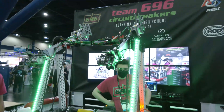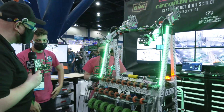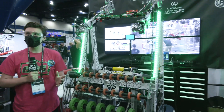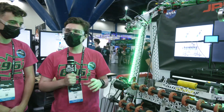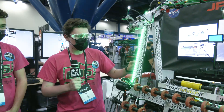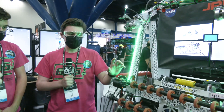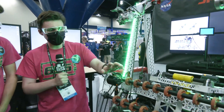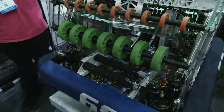That's the whole climbing sequence — it looks fantastic and has been working great. Dino, talk about sensors and programming. The first major thing is the code for the shooter. We spent two days building a lookup table instead of using an equation. We placed the robot one foot away from the hub and incremented outward, trying shots over and over until it landed every time, until we had a full table of every shooter hood angle and flywheel speed needed for every distance. Another unique thing: we had a CAN utilization problem, so the solution was running two motors over PWM instead of CAN — the intake and one serializer motor — since those just need 100% forward or 100% backward. They're wired directly to the RoboRIO over PWM.